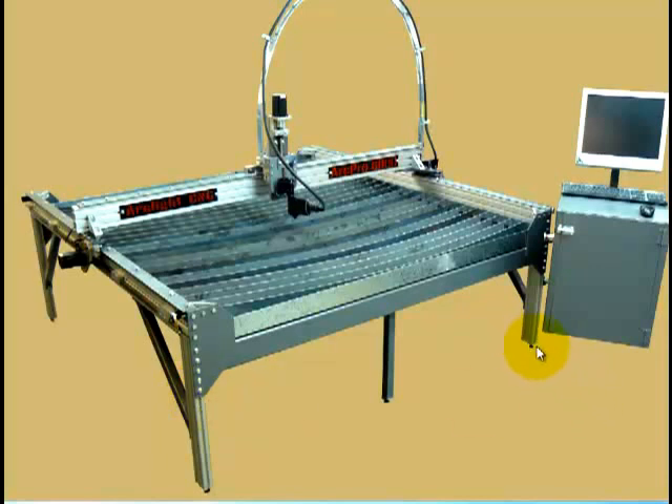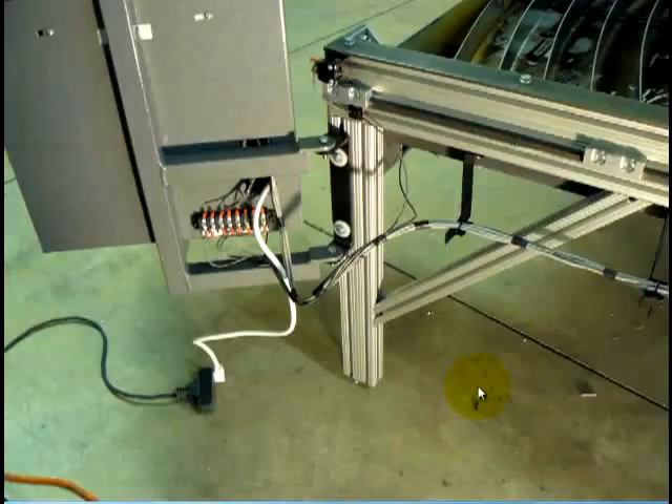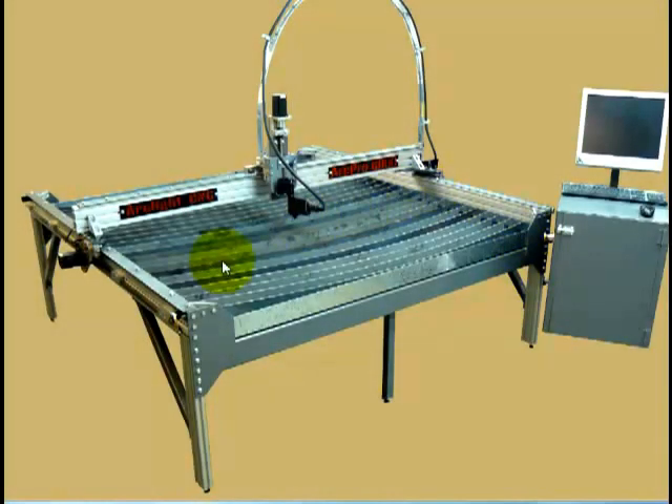One thing to notice: there will be leveling bolts mounted to the bottom of each leg. You'll want those leveling bolts facing towards the outside of the machine — furthest away from the inside — as pictured here. Also, one of the legs will have a mounting bracket pre-installed on it for your control cabinet, so make sure that as you're looking at the front of the machine, it is on the front right side leg. Once you have your front or back legs installed, simply lift up the other side of the table and install the other set of legs.